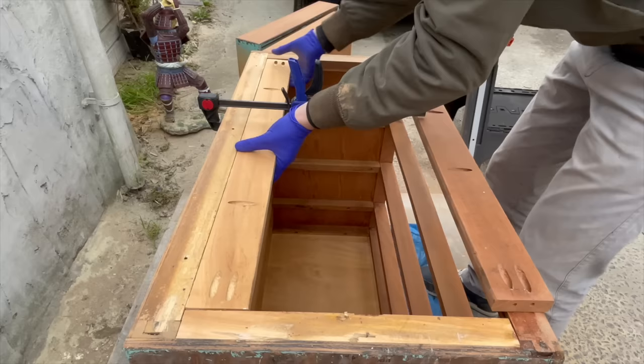I sanded the back and I used some liquid sander that I had left over from my previous project to clean the drawers inside. When I was done cleaning, I used my table saw and the remaining pieces of the skirting to make some custom pieces of trim that would match the ones already existing on the top of the dresser.